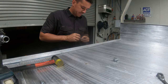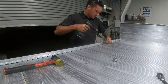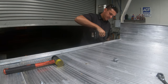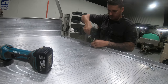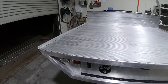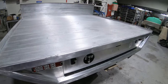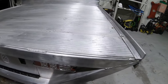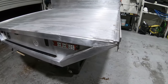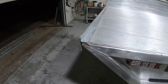Good trick: if a bolt isn't quite lining up with the hole, you can just thread it in and it should find its own way. I've managed to do it - I've shortened her up 150mm. I think it looks bloody awesome, it's come up really good. I don't even honestly think I'll need to get that re-welded, I'll just leave it as is, just flap disc it back - yeah, that looks really good I reckon.